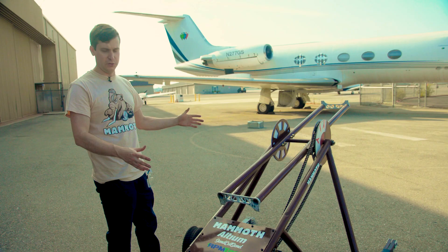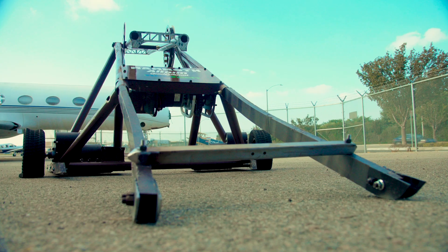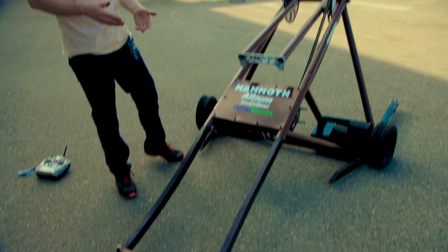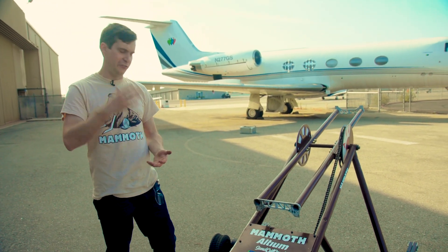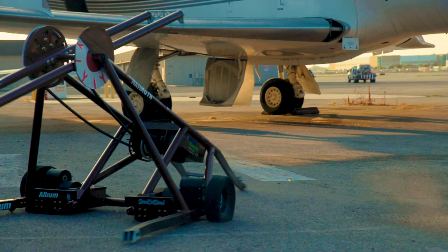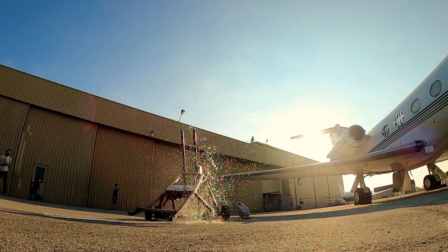There are other areas of the robot where we're going to get hit too often to rely on that kind of thing. For example, our tail is made out of a plastic called UHMW — ultra-high molecular weight polyethylene — which is a very durable, very flexible plastic. That means we can take hit after hit back here and not get things torn up. It'll bend out of place and whip right back into where it's supposed to be.